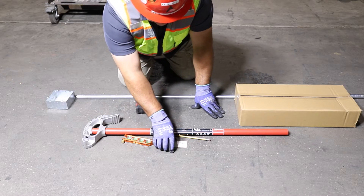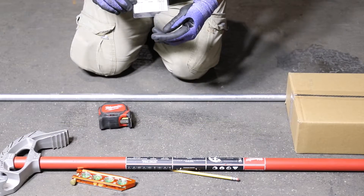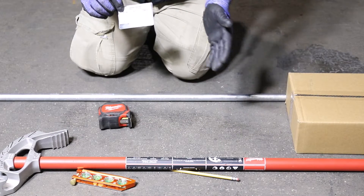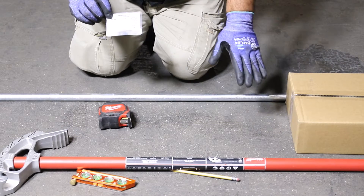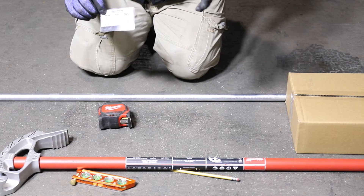For a five-inch four-point saddle, we're going to use 30-degree angles. We always want to use 30-degree angles if we can. For our 30-degree offset, we've got a physical dimension to deal with — the multiplier is two. So we have five inches of offset times two: our measurement from A to B is going to be 10 inches. And it's a quarter inch per inch of rise — that's our pipe shrinkage. We're going to raise five inches, so five times a quarter is five quarters, or one and a quarter inches.